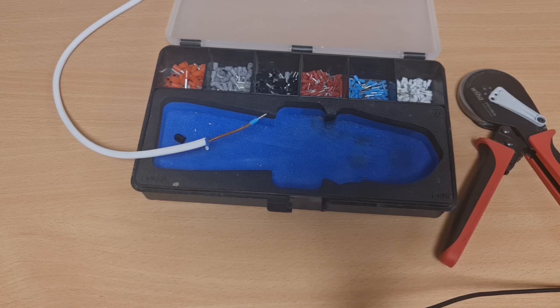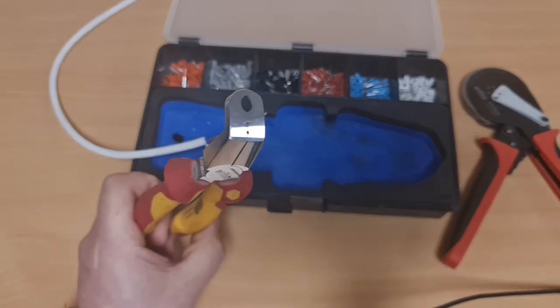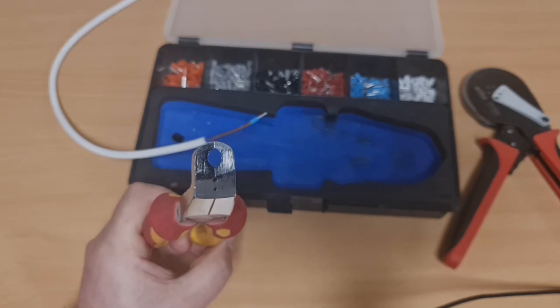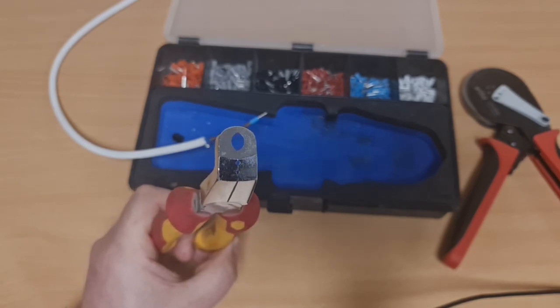With fine stranded cable under a screw head, the strands kind of split apart even when you've twisted them together - they can spool apart and you're not getting a reliable solid connection. That's where ferrules come into their own. If you were using a solid core or seven-strand conductor in a neutral bar or earth bar - say you've got a 35mm earth in a domestic consumer unit that won't fit in the earth bar rather than butchering it across two points, you can use a pin crimp suitable for that cable type, which drops the size down so it fits under the screwed connection.